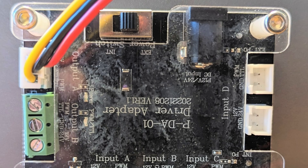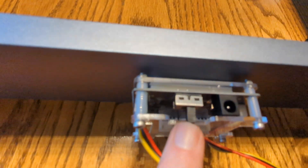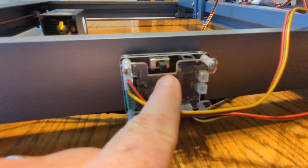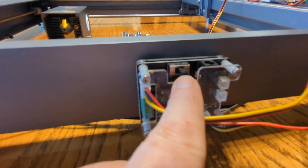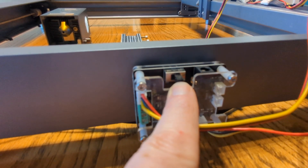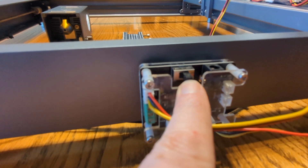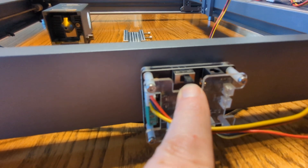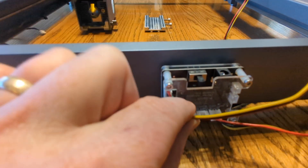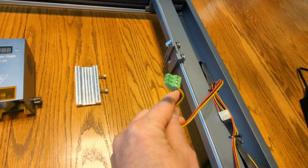The next thing is you've got this wire, which goes to the output of the driver board. I'm in the external setting, and that means it's going to use the external power supply — because the Xtool motherboard is 12 volt and the Lasertree module is 24 volt, it needs a little more power to fire the laser. So I've got this cable which they supplied to me, and that goes here — it's this green cable.